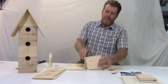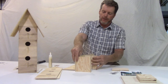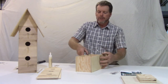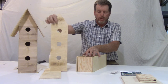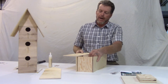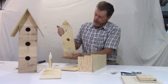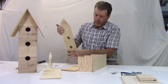So this has two ways of going. You want to know that the sides get nailed on this way. You're going to have three floors that go into the kit at certain heights when the two sidewalls are first nailed to build a box. The different distances between the holes is going to dictate where the floors are. You don't want to put a floor halfway through the access hole. So you want each floor — one floor there, the next floor just over the last hole, and the next floor just over the last hole after that.